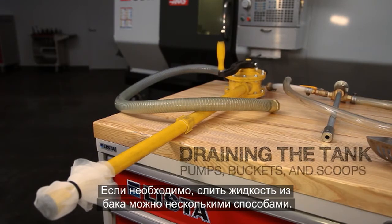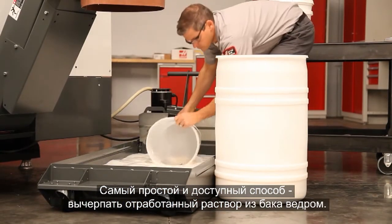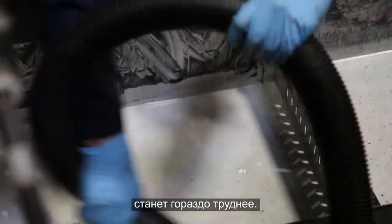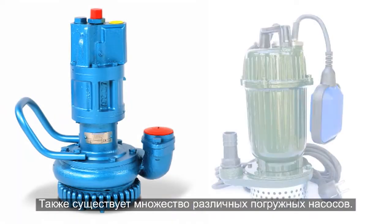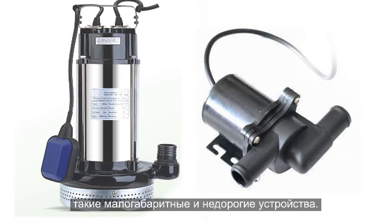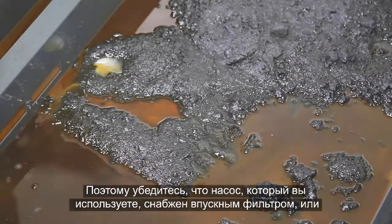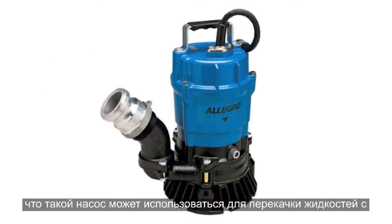When you need to drain the coolant in your tank, there are a number of ways to do this. The most readily available method is to use a bucket to bail the old solution out. This starts off easy, but it's difficult to get all the coolant out once the level is down below about 30% full. Some wet and dry vacs can be used to pump water out of a coolant tank. Also, a wide variety of sump pumps exist. Even inexpensive smaller units can often be used to drain the tank of your Haas machine. But it's usually difficult to remove all the chip particles and sludge before pumping out. Make sure the pump you're using either has a filter screen at the inlet, or that the pump is rated to handle sharp metal fragments.